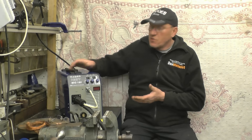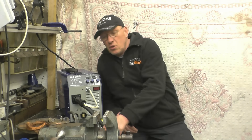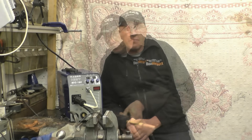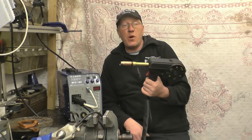Hi, my name's John. Welcome to part 3 in a series of videos reviewing this Arttec i-MIG 180 inverter welder, using the spool gun to weld aluminium. In this video I'm going to take out the roll of 0.8 wire and replace it with a roll of 1mm wire.